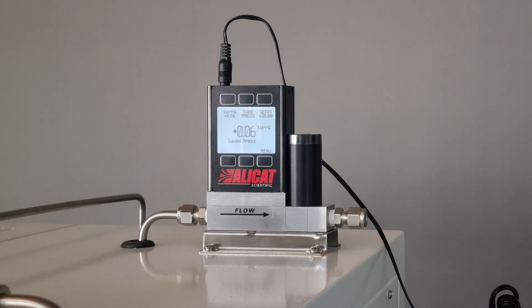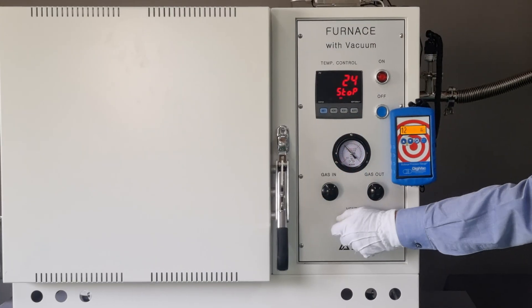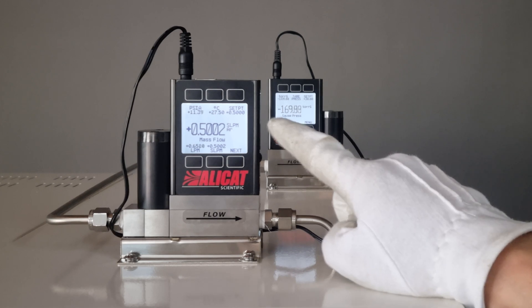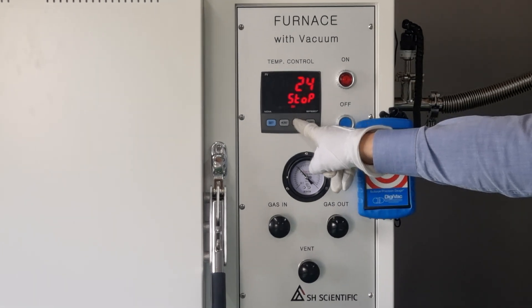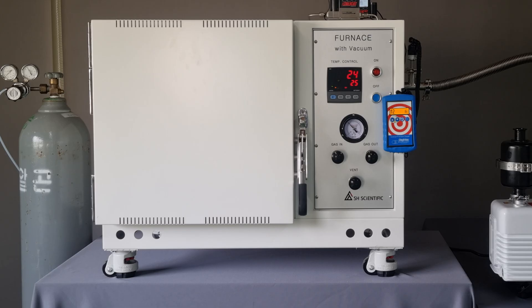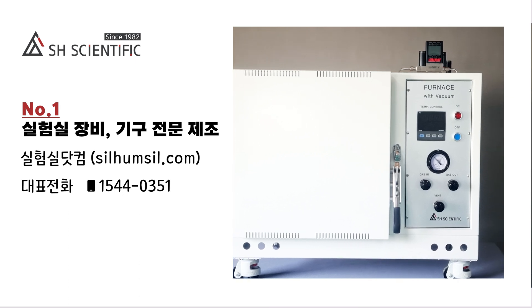By now, you've connected your gas and set up the MFC and BPR, so it's time to load your materials into the chamber. Remember to open all valves — gas in, gas out, and the vent — to enable the gas to quickly flood the chamber in the beginning. Once the chamber pressure is above atmospheric pressure, close the vent valve so the MFC can take over and accurately control the gas flow. The BPR will initially go up and down around the set point and will eventually settle right on it. Now the chamber is completely saturated with the gas, so click the Programmed Pattern 1 or 2 button for 3 seconds, and the controller will start working as per that pattern. Finally, hit the ON switch, at which point the furnace will heat up and start to run your program. Thanks for watching, and on behalf of the whole SH team, we look forward to being of service.